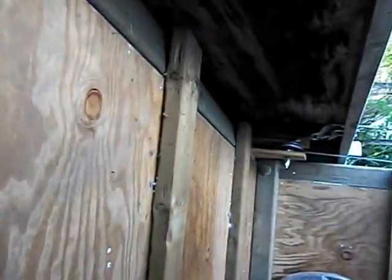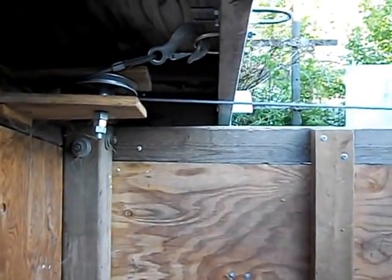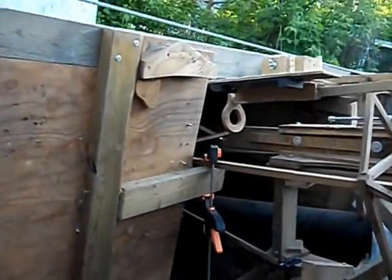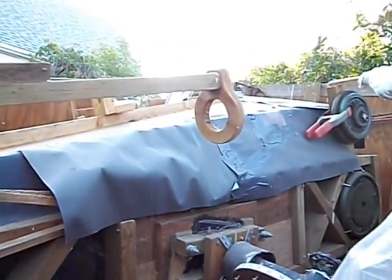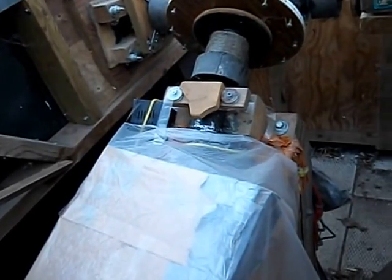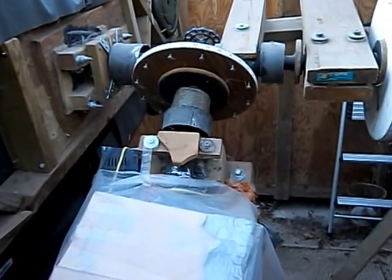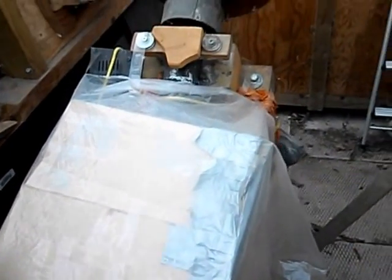In another video I'll tell how I managed to figure the mirrors — it was quite difficult. Here's the end of the winch right here — you can see there's a pulley there that I've built a homemade device to hold it on. This is part of the finder system right there — that's just an open loop finder that I'm sometimes able to use. There's the five-inch lens of the finder covered by covers. And this is the polar axis housing right here that houses the polar axis — you can see the declination axis there with the declination slow motion control. That box down there houses the clock drive — it's an ancient clock drive, very old-fashioned.